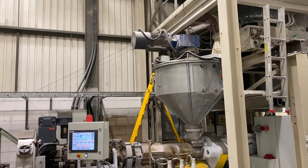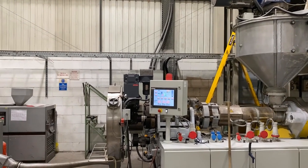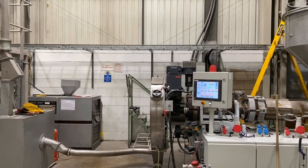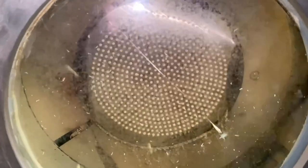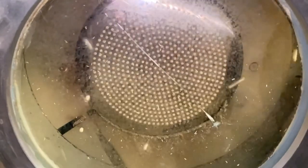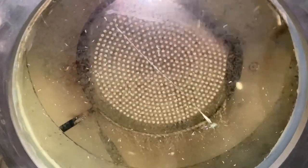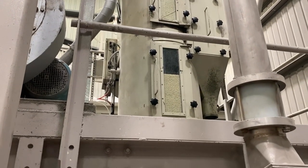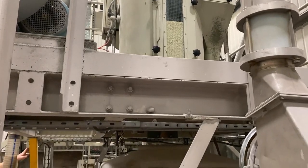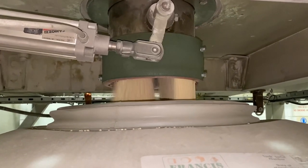We have a secret recipe PVC compound for our Twin and Earth which makes it super soft and super supple, making it much easier to terminate compared to cheaper, lesser quality products. The other extrusion lines on site use a pellet form of PVC - blades spinning at high speed chop the PVC into pellets, which are cooled down before storage. The pellets are pumped to conditioning chambers - the first rotates them so they don't stick, the second cools them further before they drop into storage bins and are pumped around site to smaller silos.